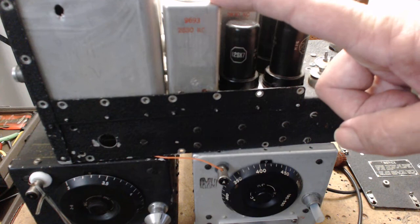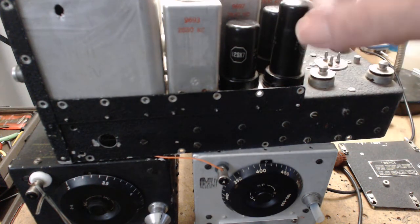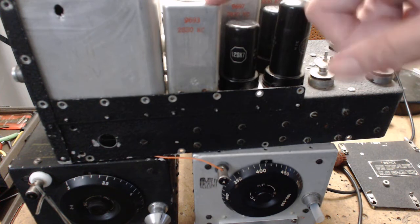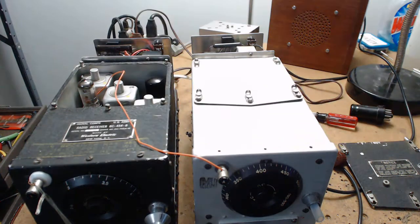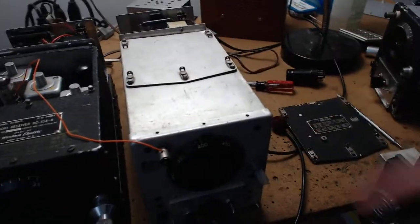It's not the way they're tuned - it's the distance between the two coils inside, the inductance. As you go up from first IF to second IF to third IF, the two coils inside get further apart and that makes it more narrow. These radios are broad or wide, but it's still a fun radio to play with.